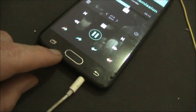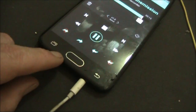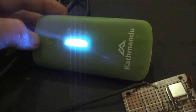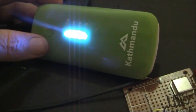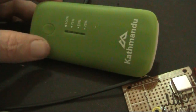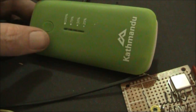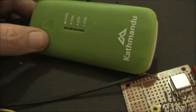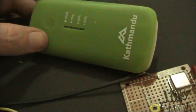I first tried to see if you could tap power from the mobile phone — that proved unsuccessful. So instead I'm using a USB power pack. This particular pack has a problem in that it requires a minimum amount of power to be drawn, otherwise it shuts off. You can overcome that by building an artificial load, or by buying a kit such as is available from SOTA beams.